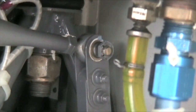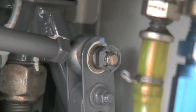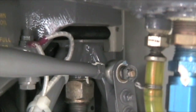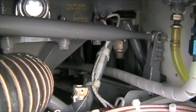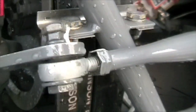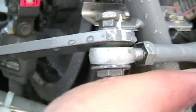If the torque stripe is missing, that can mean a couple things — it can mean that little pal nut has shifted, or most likely someone has rubbed the torque stripe off. So just verify that you can't twist that pal nut off — that's the outer one. Torque stripes on the push-pull tube: check that it can roll, but it shouldn't have any lateral or vertical movement — it should just twist freely. Also check for full travel, no interference, and everything smooth. Follow this push-pull tube down outside the cowling, make sure the torque stripe is good — twist it, but it shouldn't move to the side or up and down.